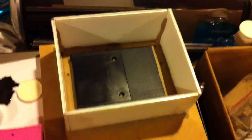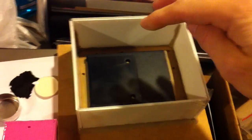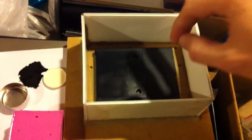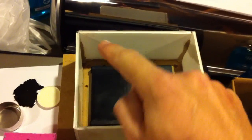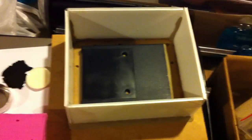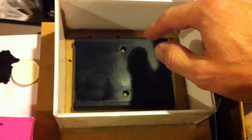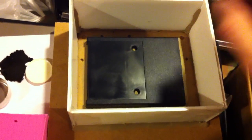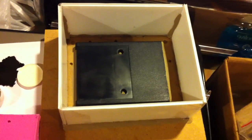So the final part is to show you what I made up last night — this will give you an idea of how it works. There's the top half of one of the cartridge cases. You can see I've got a box all made up around it, which is going to allow me to pour the silicone in. The box is sealed at the edges with the classic clay modelling clay all around the bottom and on the inside edges, and it's taped together so the silicone doesn't go splurging out the sides. When I pour the silicone in here, it's going to cover that first half by about a centimetre. I'll let that set, and hopefully it'll all pull off nicely, then I'll turn it over and it'll be ready to make the second half of the mould.